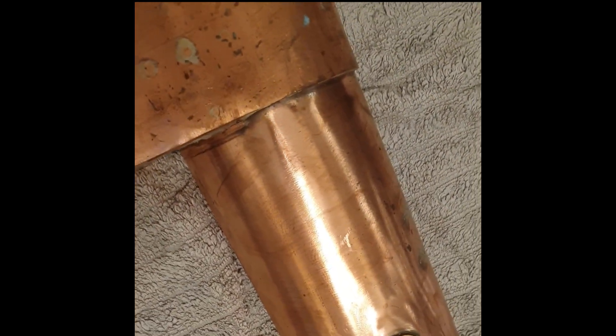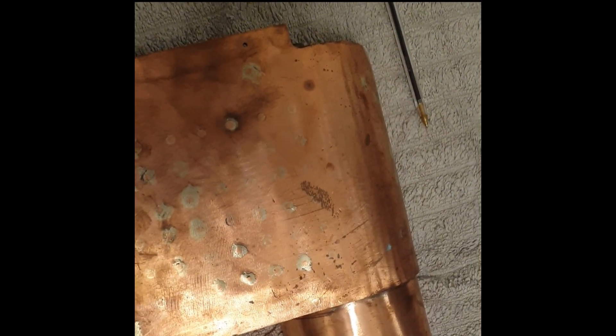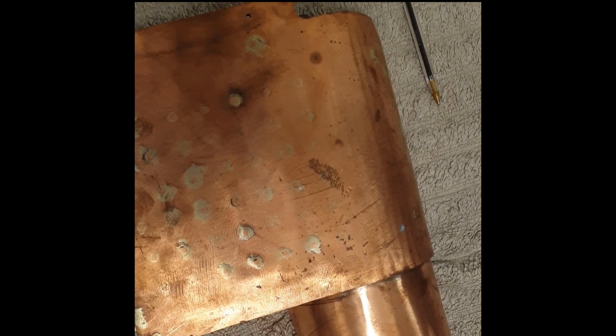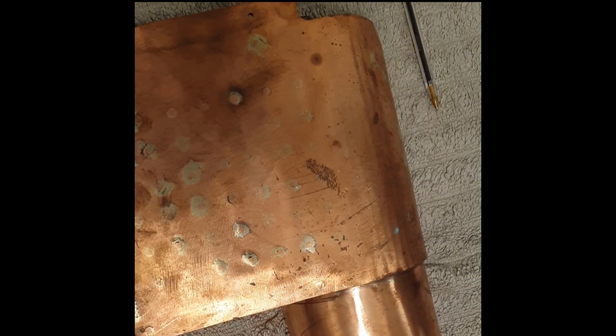As I say, there's obviously a tolerance, but the gap mustn't be too big, otherwise the silver solder won't adhere to both sides of the joint - it will just disappear through a big hollow. So I'm trying to go along with Quinn at about two thousandths of an inch gap for the major joints. The tubes and the rivets will just fall through the holes that we'll drill in the plates. So let's see how we go.